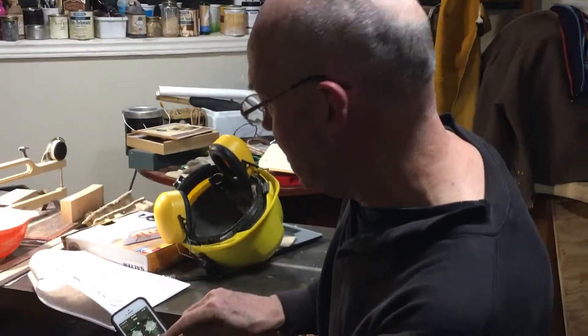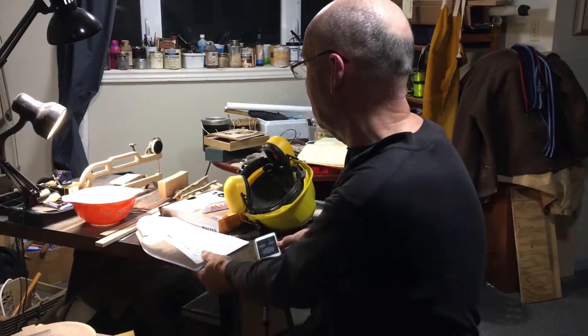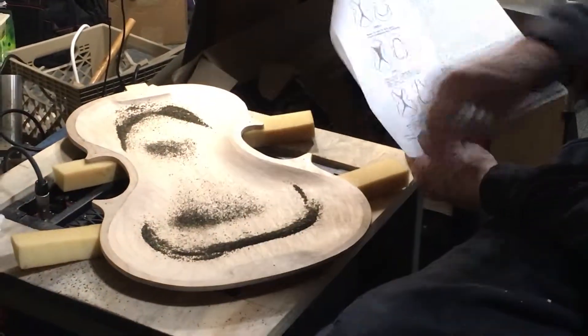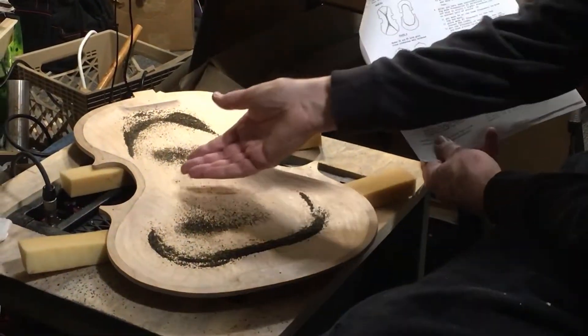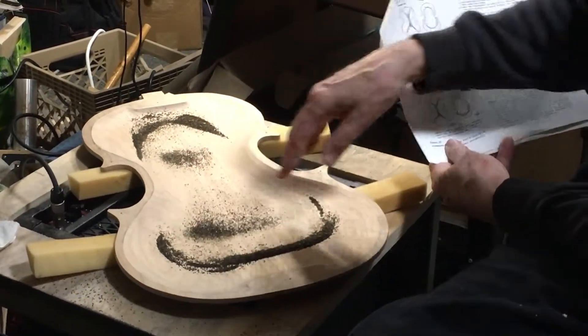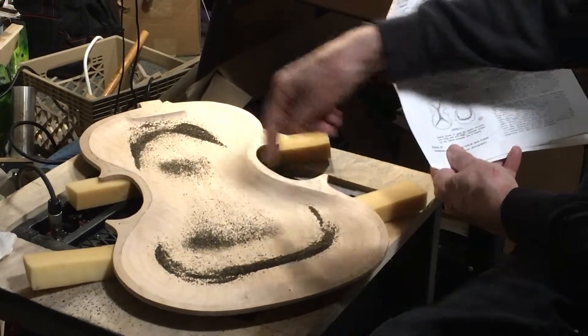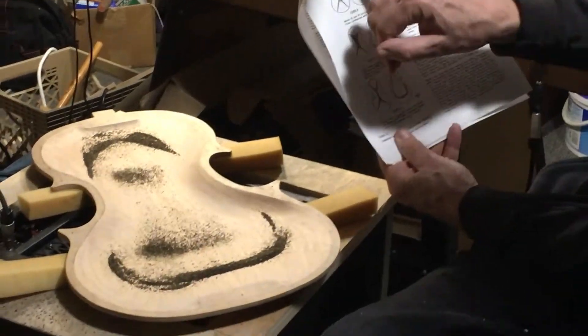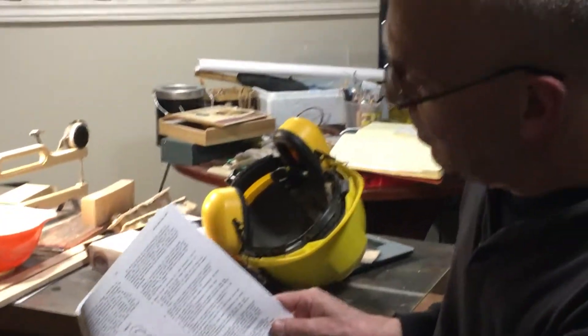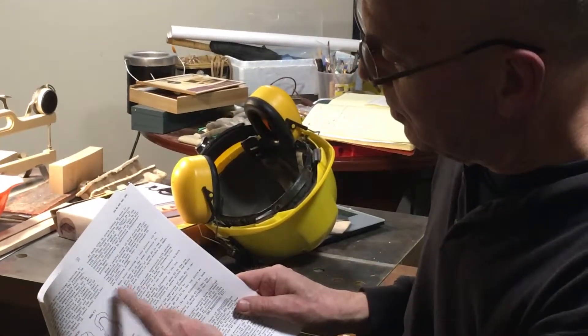So we've got our frequency — that's our design frequency for this mode, 200 — and that's exactly what we were hoping for. A nice circular pattern showing beautiful symmetry is showing the plate is a nice even thickness. The curvature here is very steep, so the tea is not sticking in this rapidly curved position, but staying nicely at these nodal lines here. So we've tuned mode 5 perfectly, and a minute ago we had also shown the beautiful X pattern for mode 2. So I would say this plate is ready to go, which is pretty exciting.